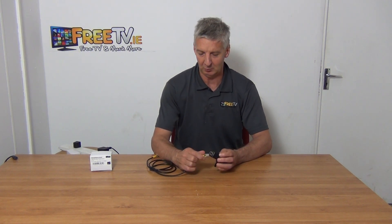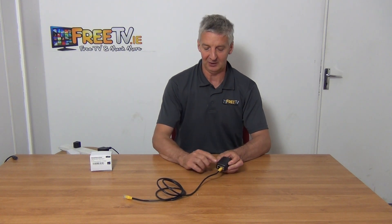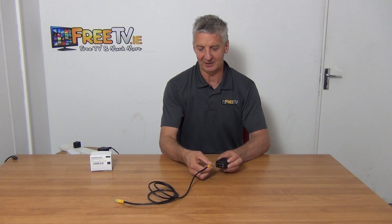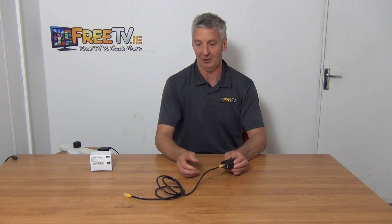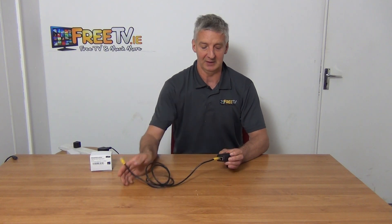There's a LAN and a PoE port. The LAN side is an input port — we connect it there. When we put a cable in on the output side, it'll effectively carry both the data we had originally, plus the power now. So this combines power and data. It's just adding the power directly in. It's an extremely simple product with a huge, wide range of applications, and we sell absolutely tons of these because it's a simple product to use.